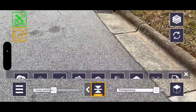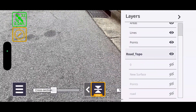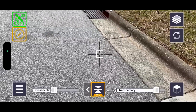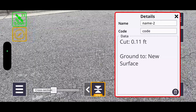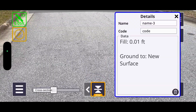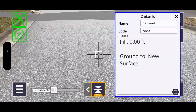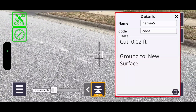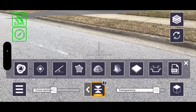Now let's look at checking a cut/fill. I'll change over to the cut/fill menu and turn my road surface back on. Using the EDM, I aim where I want to check the surface and tap the EDM button — it automatically gives me a cut/fill reading. I got cut 11 hundredths right there, based on ground run topo with an R980. Hitting it again: fill a hundredth — checking really good. Fill flat right there, and one more shot — cut two hundredths. If you just need to go out and do some grade checks, this is a fantastic tool.